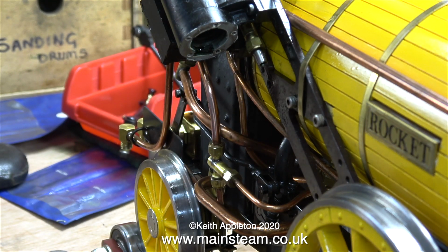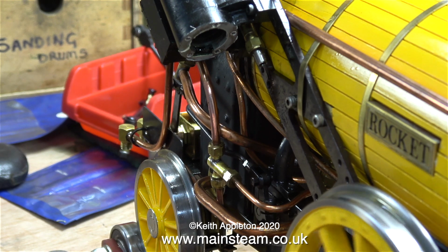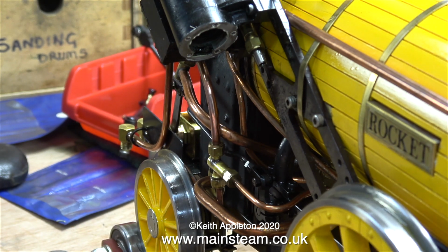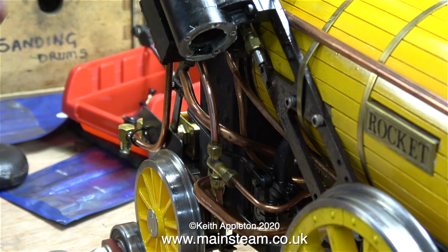I don't think I meant to admit quite as much pressure into the cylinder, but anyway, the piston and the crosshead and the cylinder cover are now not attached to the cylinder itself. And here you can hear the valve events, as the slide valve admits air first at one end of the cylinder and then at the other end, so everything's okay there.